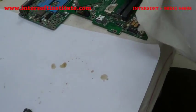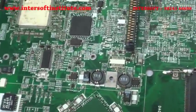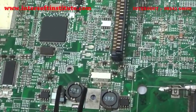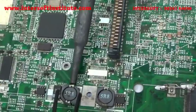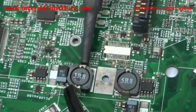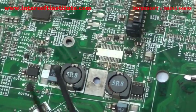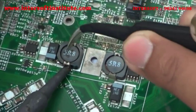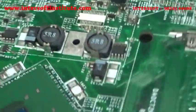Now we are inserting the same coil back on the board. We will put it in place, then apply some paste. The pad is below the coil, so we have to give pointed heating to the bottom of the coil — from one side and from another side. The solder is now OK. Now we will apply some modification with the second part of the coil.